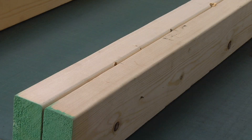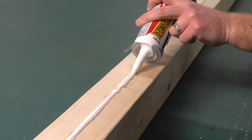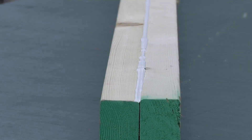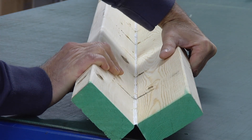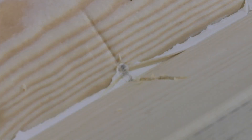In the same exact test, we demonstrated a silicone caulk seal using a standard caulking gun. It was applied with a standard 3/8 inch cut, with the bead applied directly onto the seam. Extra attention was given to the holes left by the fasteners. With the caulk, there's a lack of surface penetration in the seam — no surprise, considering caulk is not pressure applied, laying only on the surface. The caulk does not inject into the two-inch deep holes.